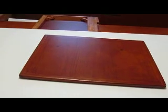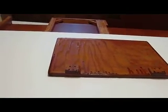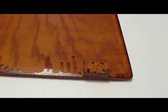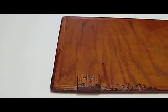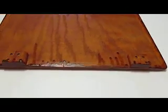Here's one of the shelves that I've pulled out of the table. I talked in my earlier video about how they could be removed. From the top it's just rectangular. Now let me flip it over. What you can see now that it's upside down, you can see the stops that I talked about earlier. The stops are just pieces of wood that are screwed to the bottom of the shelf, and those are the things that prevent the shelf from falling out or from being pulled out incorrectly.